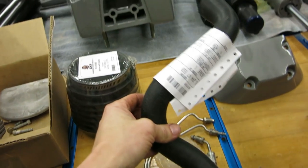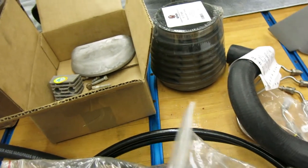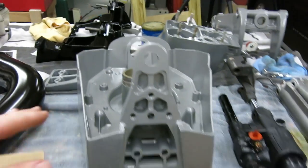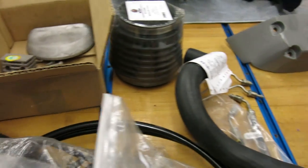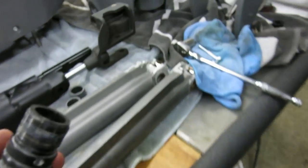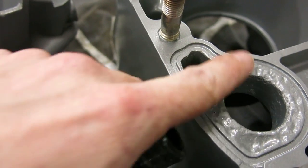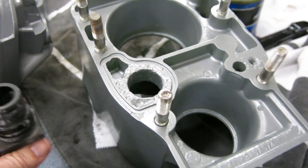I did pick up a new hose — this is the hose that goes from the plastic cooling port back up to the main housing. I had to cut mine to get it disassembled because the plastic port was so stuck into the gimbal housing or pivot housing. There was a lot of corrosion right in this area where all that salt water just sat, so the only way to get it all out was to actually cut that hose.